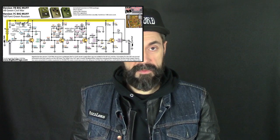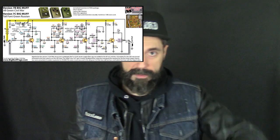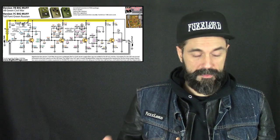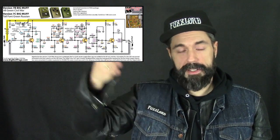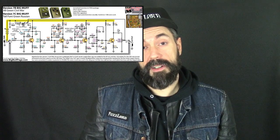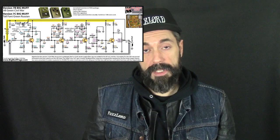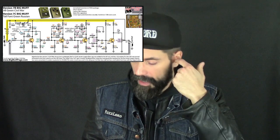So here's what we've done so far. We took a guitar signal in, which is like a little wiggle, right? We amplified it once. We limit it with the sustain control, and then we go into 2 more gain stages that have the soft clipping, which creates a whole lot of sustain and fuzz. Really cool, pretty simple, very like building block. We got 1, 2, 3 blocks.